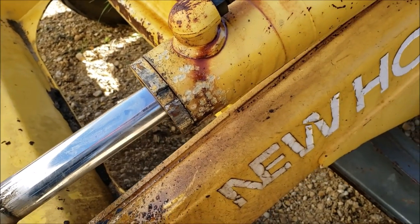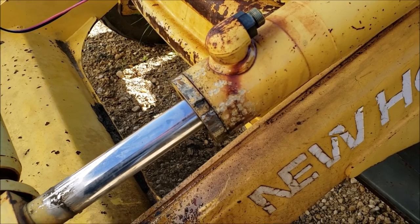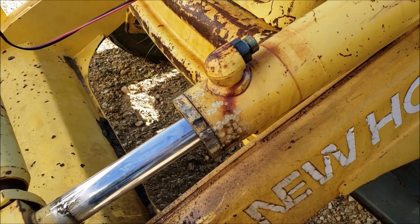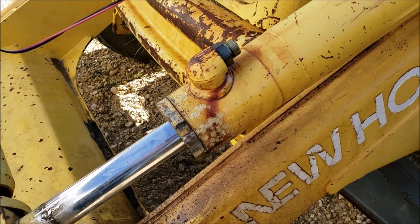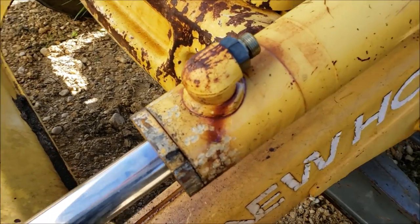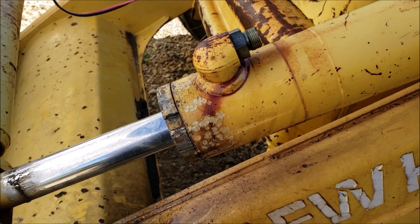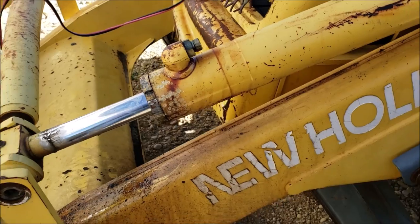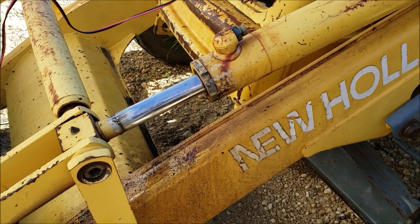The next thing I did was what I typically hear to do, and that's to heat them up. I didn't want to use a cutting torch because I've heard that too much heat will warp the cylinder bore — that tube. So I have a propane torch that gets pretty hot. I put it on there. It wasn't hot enough to really burn the paint, but it did get hot enough to boil out hydraulic fluid in there, so I know it was getting hot. After it cooled down, I put the spanner wrench back on and it didn't move whatsoever. I was almost at the point where I thought I was just going to have to rip this whole cylinder off and bring it to a shop.